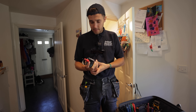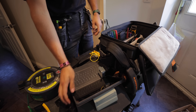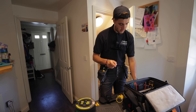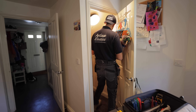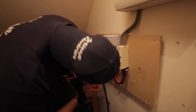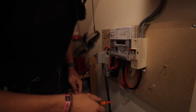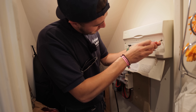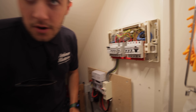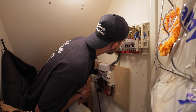I've got this sent to me — pretty sweet, I can clip that on the side of my bag. I didn't want him to think I was ungrateful for not thanking him yet, I just genuinely hadn't got around to using it, but now I have — thank you very much. So we've arrived at our EICR, got my little table set up. First thing — look at the main head or the metering. Is it all okay? All in place, no gaps or holes, can't see any copper. See what type of earthing setup it is — it's a TNCS or PME system, see the earth and neutral combined. Got an isolator — make sure there's no copper, any gaps, no signs of burning, evidence of heat. All looking good. Let's do the big reveal. So we've got two newer circuits here, some older ones, and another newer one. It all looks okay.